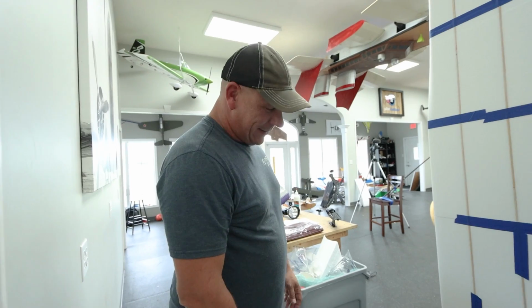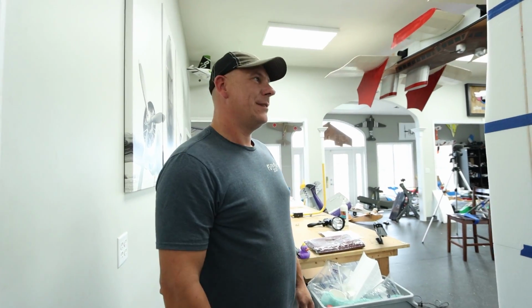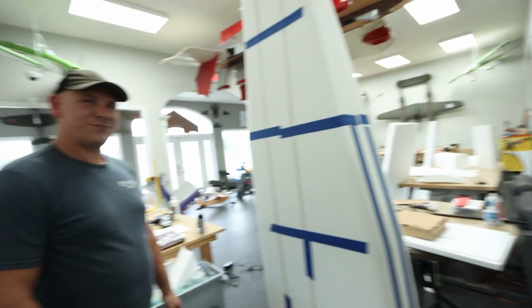We got a 7-pound wing and a 4.5-pound fuselage. And here's where it's really important. A lot of times people dream big, they start building big, and weight creeps in on you quickly. So even though this is incredibly light, we still have electronics and batteries and landing gear and things. It's good to always stay light and strong, because you can always add weight where you need strategically.